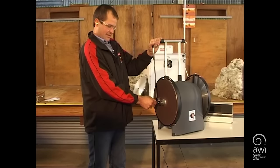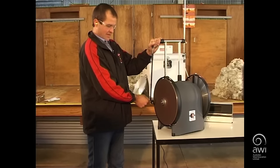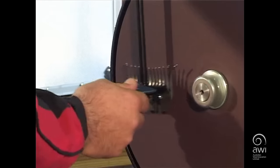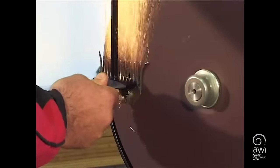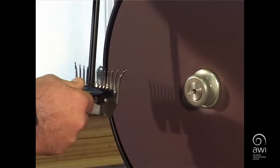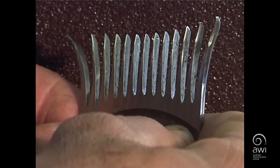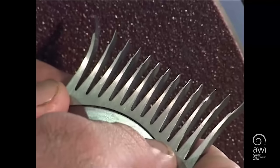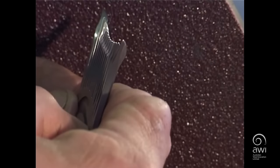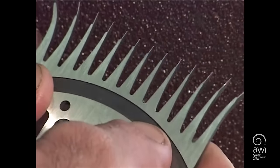Using good firm pressure, come on, go two to three teeth off, back to the centre, two to three teeth off, back to the centre, and using good firm pressure come back out to where you set the pendulum and snap it off. You can see this comb's edge is quite round — it's not up yet. So we'll re-grind it and after grinding make sure all the edges are sharp and come to a straight edge. Along with the perfect hollow from the radius line, this will give you the optimum cut.